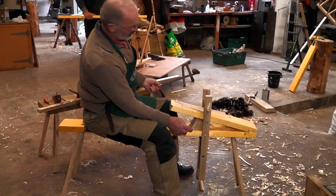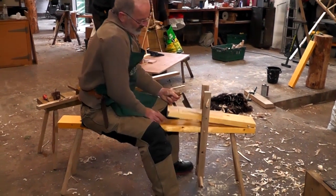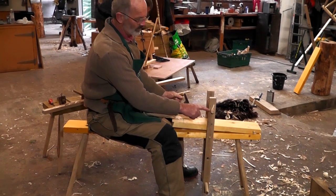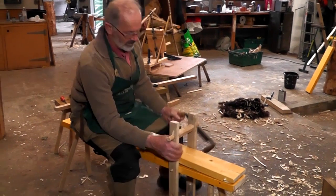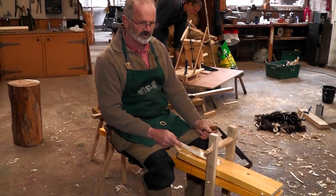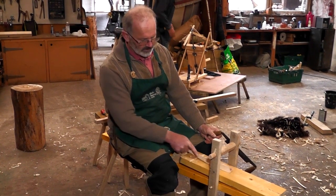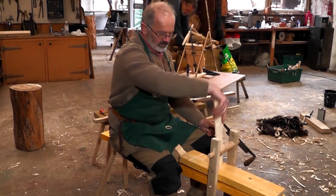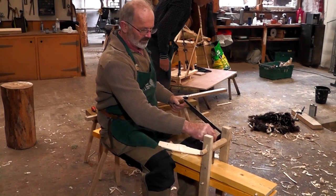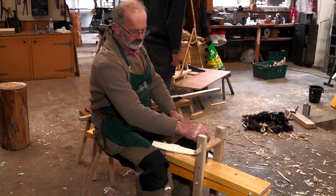The throat distance, that is the distance between the tongue of the horse and the hitting arm at the top, that's the throat distance, that's critical and should be something between 3.5 and 4.25 inches distance vertically.